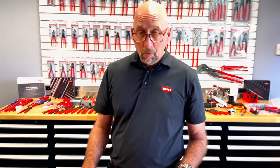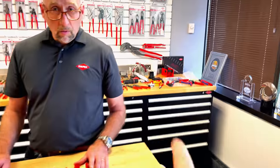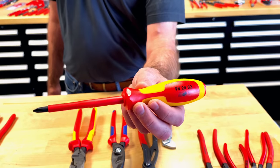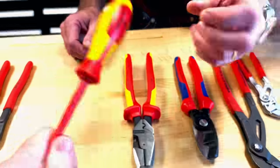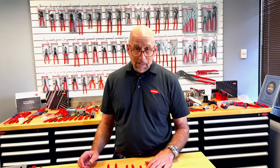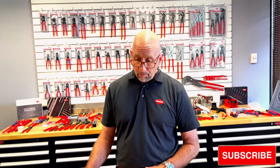If you bought a pair of red and blue multi-component handle pliers, that does not mean you can go cut live wires — that's just a safety thing. It's similar to the difference in your screwdrivers: using an insulated screwdriver in an electrical panel is safe, but using a regular screwdriver and hoping you don't get a shock — if you're doing that, that's on you. That's what the tools are not designed for.